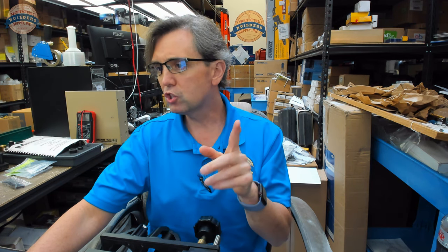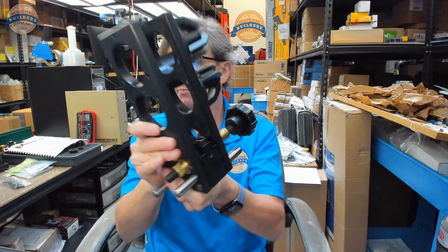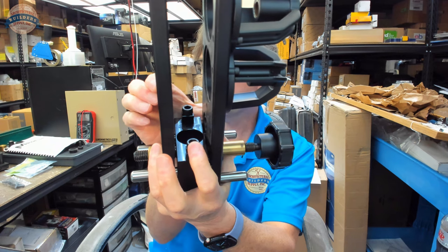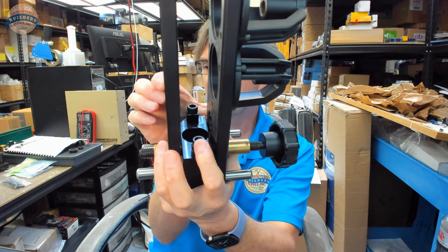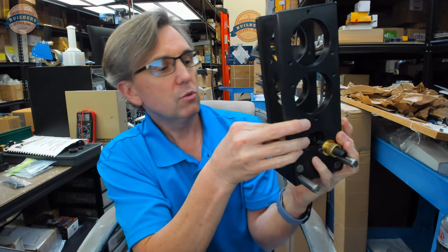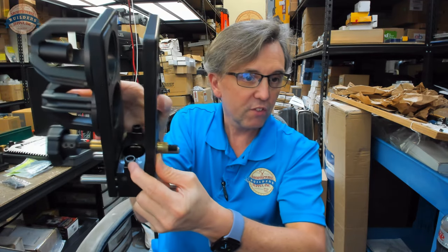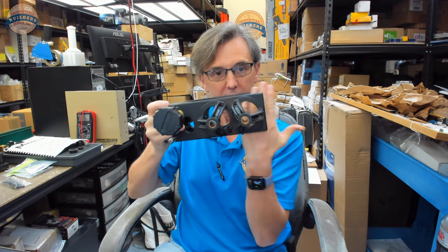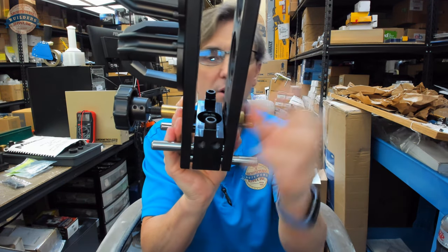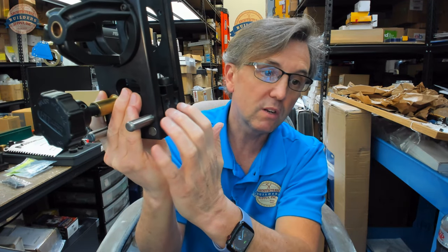So to adjust for 2 3/8, 2 3/4, and 5 inch back sets, install the bracket studs as shown in the picture. Make sure studs are fully threaded in. So the bottom line is they're already installed. You can remove both of them. You need two of them because when you clamp that onto the door, you want that to sit flat. So there's two of them, here and here. You can remove them, which you'll need to possibly, and you can nest them here.